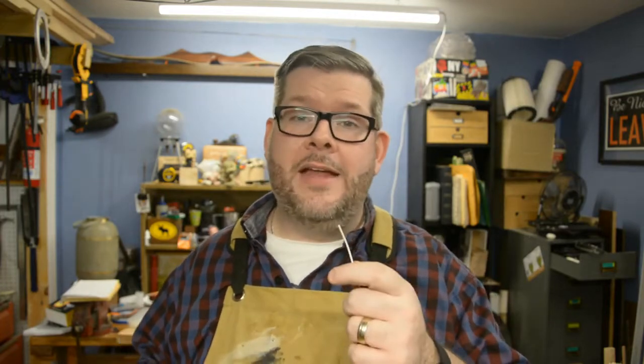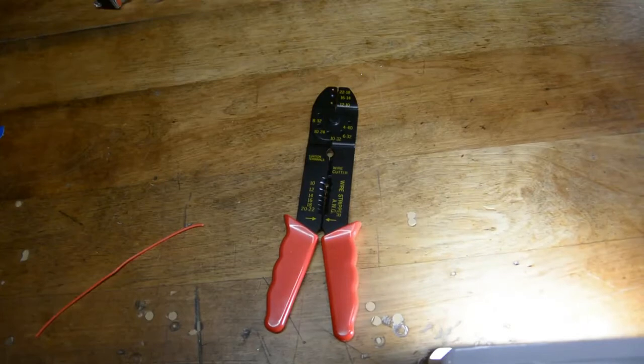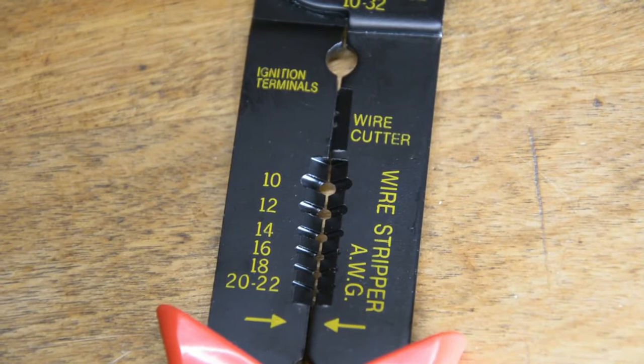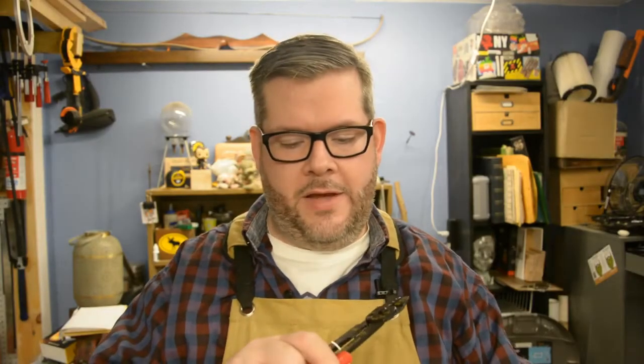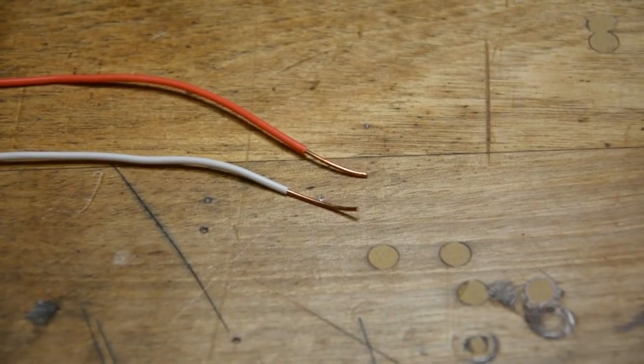As we go through this project, I'm going to show you simply how to use all of these tools and explain exactly what they do. The first thing you want to grab are your wire strippers, then take each of the pieces that has a wire, go to the end, and strip it. Take a look at your wire strippers — just above where the handles are, where the two pieces of metal meet, there are small holes of different sizes that have been sharpened. Line that wire up with the right size hole, squeeze it tight, and pull. That exposes the copper wire underneath the insulator.